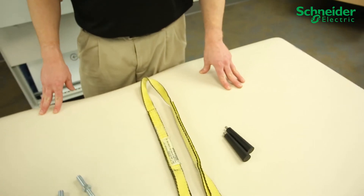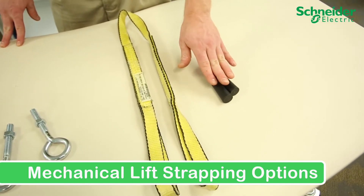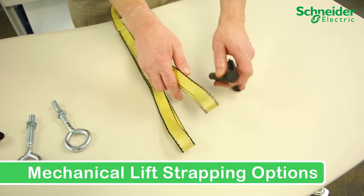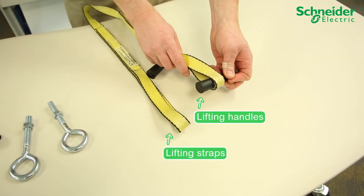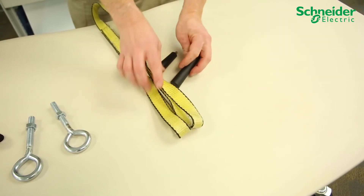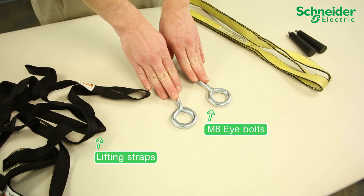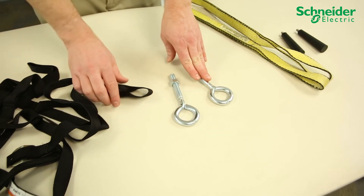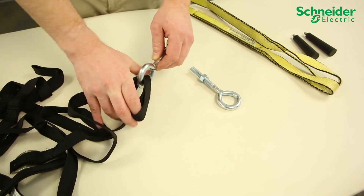When using a mechanical lift, there are two ways of attaching strapping to the CL60. Firstly, the supplied lifting handles installed on the CL60 can have a lifting strap placed over the top. Secondly, you can replace the top handles with M8 eye bolts, which using a standard lifting strap would simply slide through the eye bolt and be used to lift the unit into position.